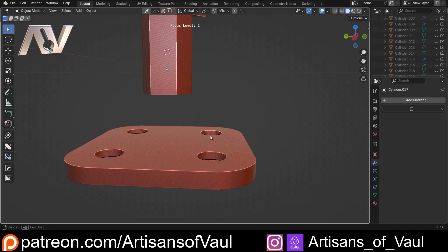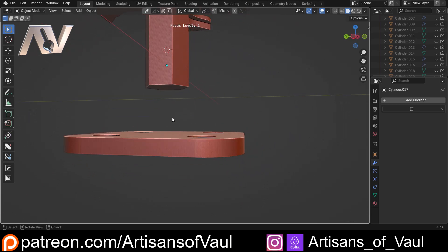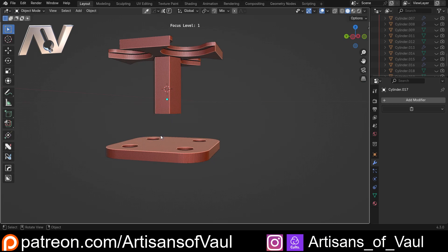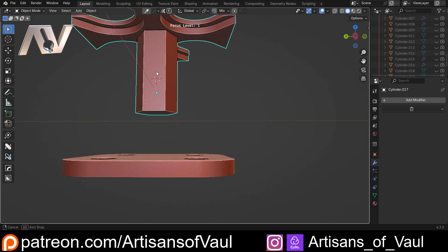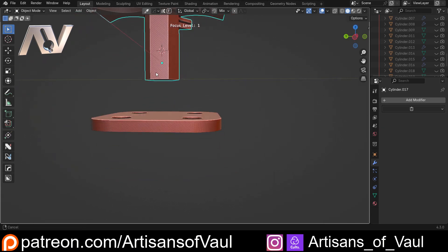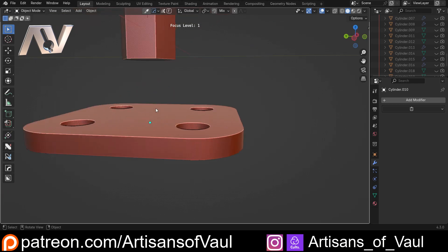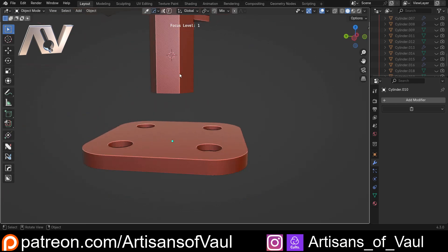I'm currently working on a design and these are two parts of that design. I need these to be joined together, and for 3D printing purposes I really don't want any supports. The idea will be that this would be printed upside down, and this piece here has all of these holes at the top, so neither needs supporting. I can print these both flat on the build plate and get nice smooth surfaces because there's no supports.